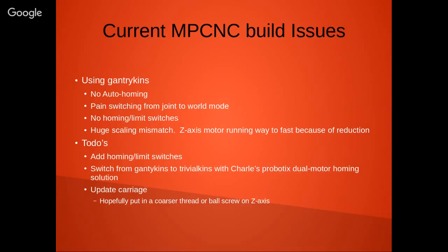Part of the limitations of FreeCAD originally was that if you wanted to map to a face and then do some pocketing or other things, you were limited to that face. And in the tool chain, if you made a change earlier in that model, it would tend to break the face, and you'd have to relink and do all kinds of things. This is specifically one of the things that they're getting around in 0.17. But there's not a lot of documentation at this point on those particular features in modeling. So it's a bit of a learning curve right now.